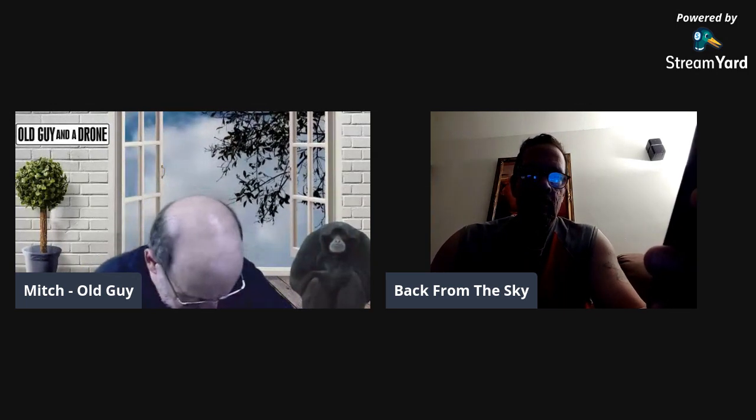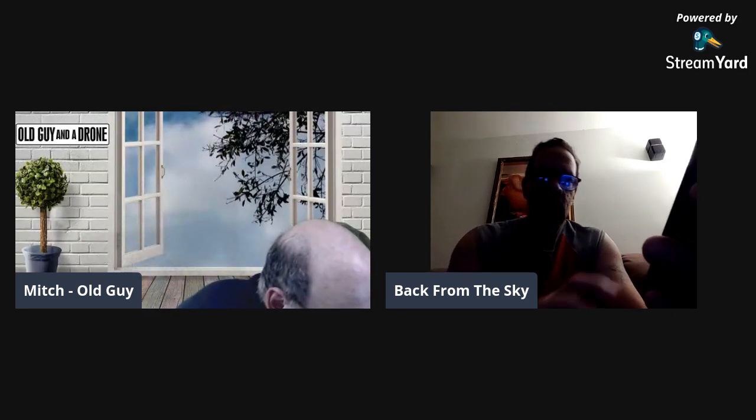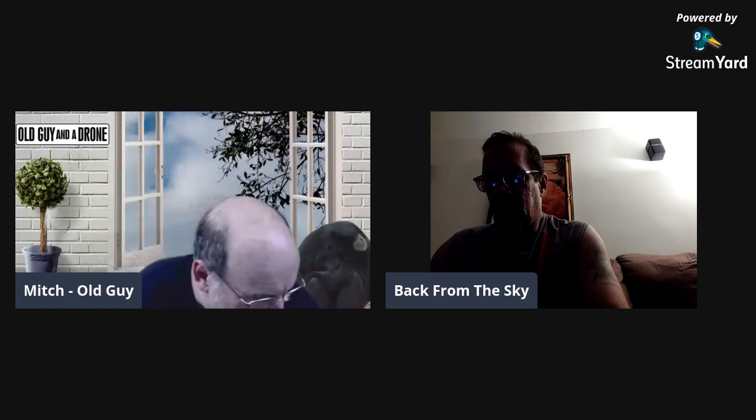Okay, so what I want to do is I'm going to try this again here. I'm going to turn this on. I'm going to plug in the air unit. And again, all you need for the air unit to work is power. You don't need UARTs. You don't need anything. I'm going to push the bind button. It turned green. It's supposed to turn red when you're ready to bind. All right. Let's push the bind button. It turns red. Push the bind button on the goggles.